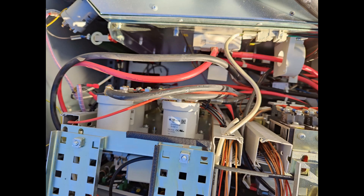Above the capacitor, a little to the left of center in the picture, we have these contactors, which are cylindrical in shape. There are four of them and each can break 500 amps DC at 900 volts. These contactors control the output of the high current DC fast charging.